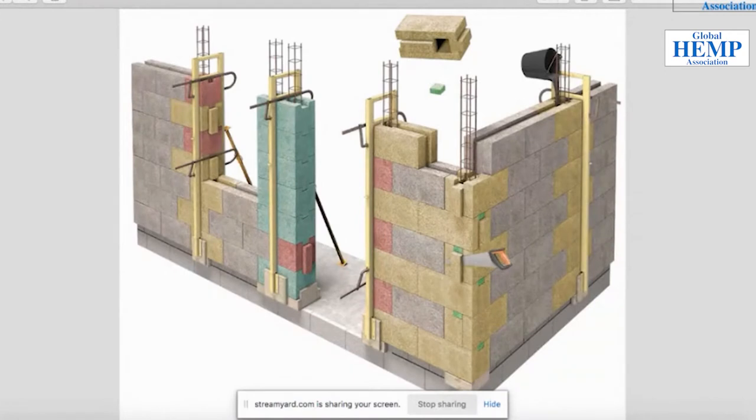Once you've done the walls, you can render them with stucco or render. We encourage lime render, which we sell in a lot of colours. If you put a concrete render on a hemp block wall, you're actually going to stop the air passing through the walls. One of the biggest advantages of using hemp block is that in the building envelope you have air passing through the walls, which acts to control temperature and humidity and really helps with indoor air quality and comfort.